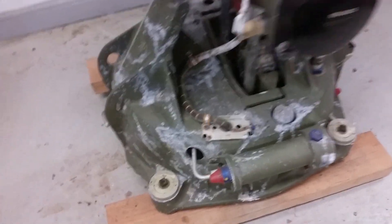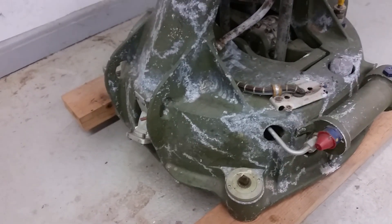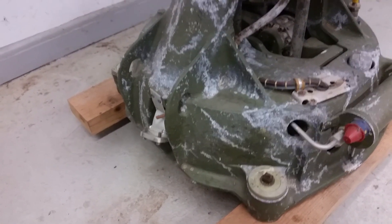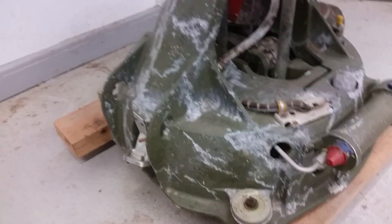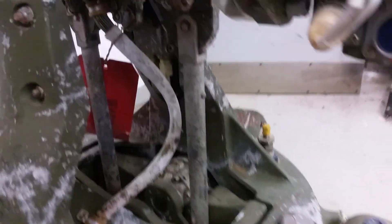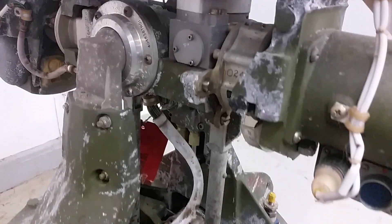These were used for essentially the final approach of the missile. The initial flight of the missile was controlled by the SAGE system, but SAGE wasn't accurate enough for the very last bits of the intercept. There's the X-band waveguide nozzle - it winds around in there. There are obviously flexible rotary waveguide joints and all sorts of stuff to get it out the front.